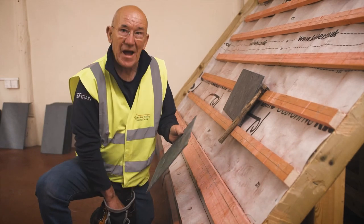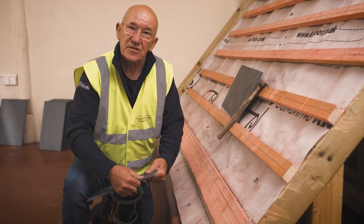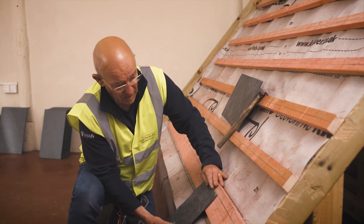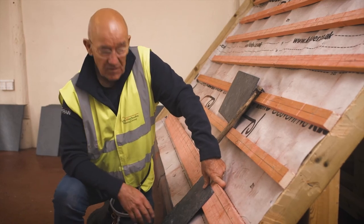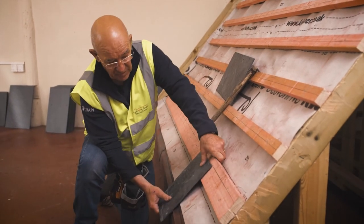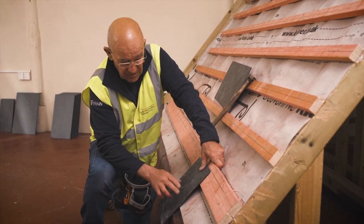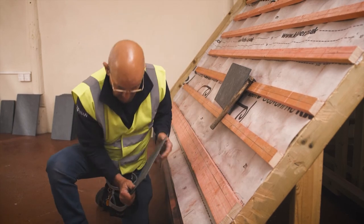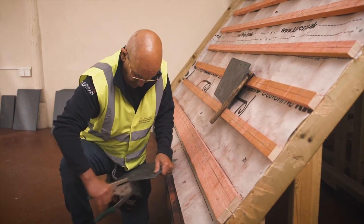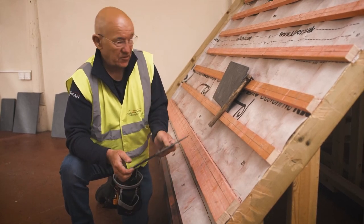I've holed the slate from the back so that when it goes down and the nail goes in, the nail sits down flat and it doesn't kick the slate above it upwards. You can put the slate eave down with the ribbed edge up, or you can just as easily flip it over and put the eave with the flat side up. It doesn't make any difference at all, whichever is your preference. The only difference is if you do it with the flat side up, then you would hole it from the back so that the countersink is on the top. But it makes no difference — whichever is your preference is fine.